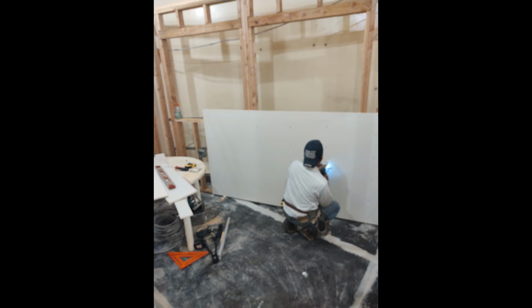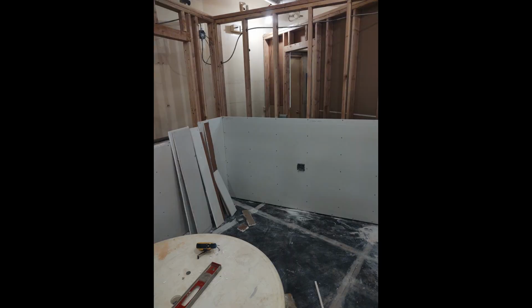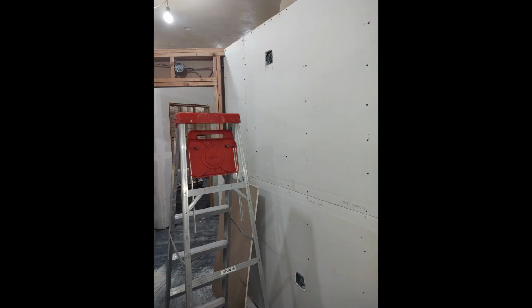These two openings you see there, we're going to do just like we did at the lower level, in which we can put shelving in there. But temporarily, we'll just fur it out on the inside and then drop some drywall in it. And then when we're ready for that, we'll pull that out and bring the shelves in. And you can see us going around, dropping in the sheetrock. But what a fun project.